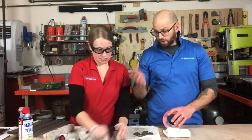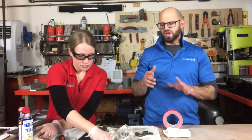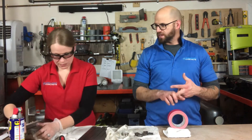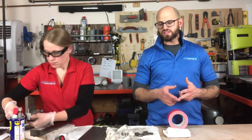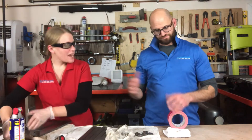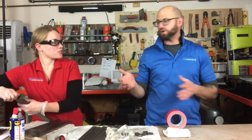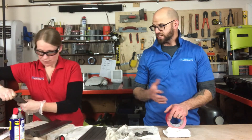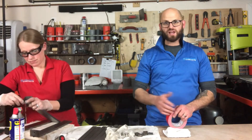Outside of that, it's a great material. What are the pros? It allows water to go through. They use up a space without flooding — that's a byproduct of water flow. They can be used and maintained for pavements. They can be used for aesthetics — you can have grass and things coming up through them. And it is less expensive: your cement is the most expensive piece of the mix, but 15 to 25 percent of your mix is air, so that air is the free portion.